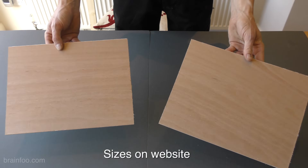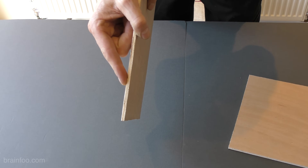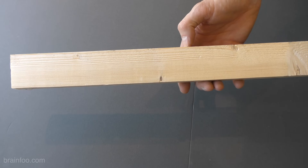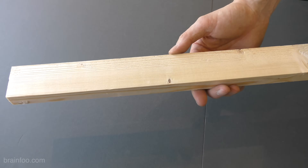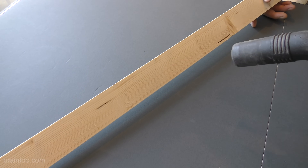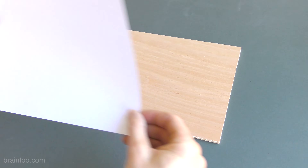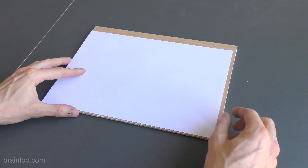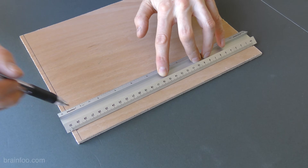For the top and bottom I'll be using these off-cuts of wood — any sort of plywood or MDF will do, no more than a quarter of an inch thick. The side walls are made from some 2x1, and a 4-foot length will make both the former and the handles. Just remember to make sure that your vacuum cleaner will fit inside the 2x1. I'm making mine A4 size using A4 as a template, but you can go virtually as large as you like depending on your needs.